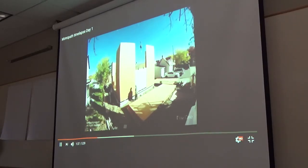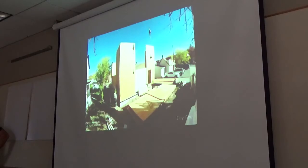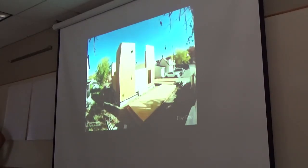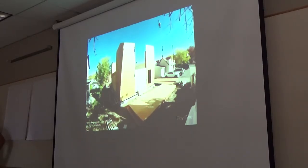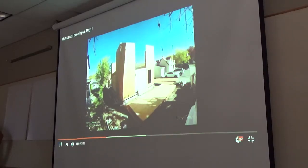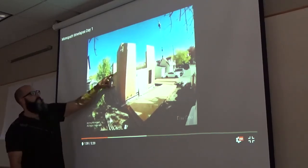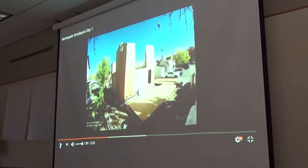All right. So this thing will go around. We'll set these panels all the way around on the interior. The second you complete that perimeter, you no longer have access to the inside. So you cut out one of your door openings. As you see, the front door got cut out right away. Don't forget the header. And then you see they put the ledger in. The ledger started to go in, right? And then they started stringing those across. So we're just going to skip that step altogether.